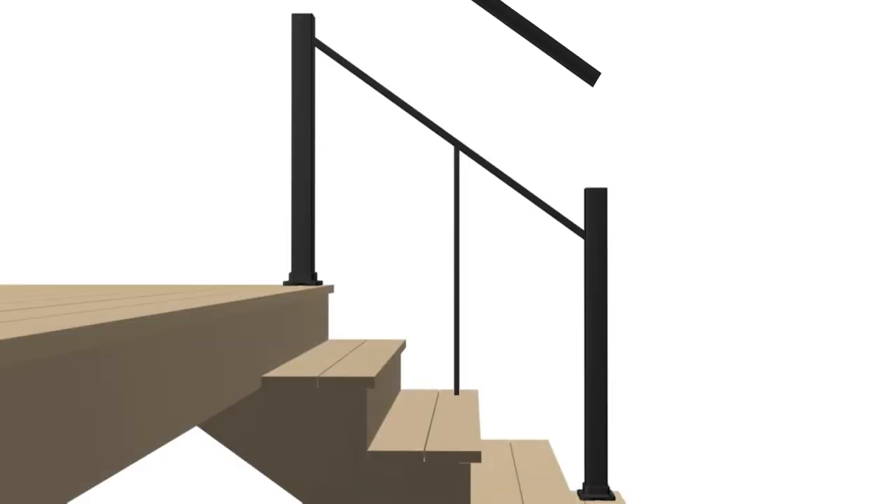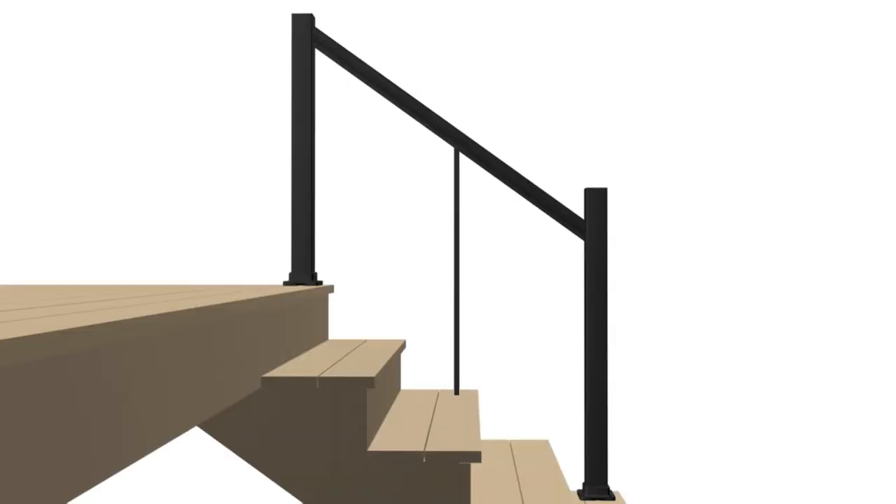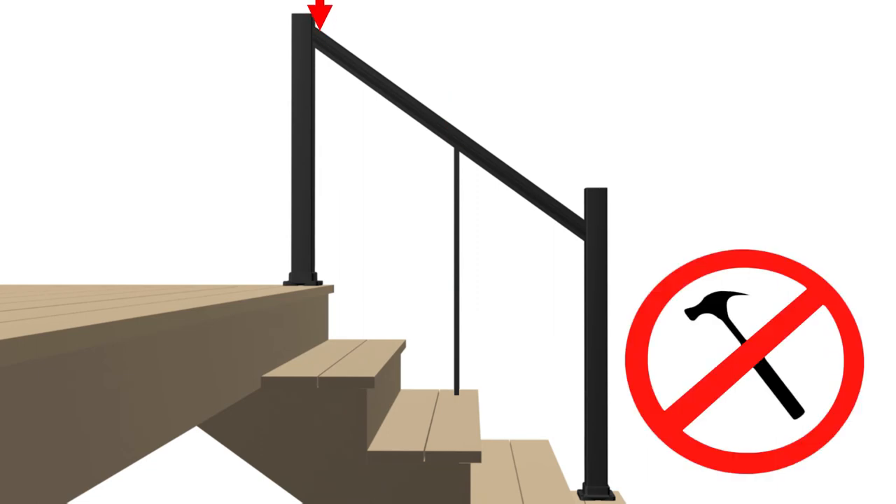Following the same angle as the secured U-channel, clamp or hold the top rail snap against posts and mark for cutting. Remove clamps and cut top rail snaps 1/16 inch less than the opening size, taking care to cut at the appropriate stair angle. Clean cut areas and apply touch-up paint on exposed ends. Push the top rail snap down onto the top rail channel until properly seated. Helpful hint: Apply downward pressure on the top rail starting at one post and working towards the other post. Do not use a hammer to secure the top rail.